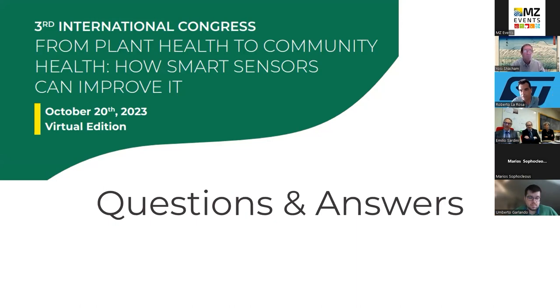That in the future could be paper or cork or whatever is the material that is more eco-compatible. In this moment, it's PET. And we are trying to put on this substrate, to actually print on this substrate, the photovoltaic cell, an organic photovoltaic cell, the antenna, and eventually also the capacitor. So anything which is beyond the silicon, we are trying to print in this kind of materials.